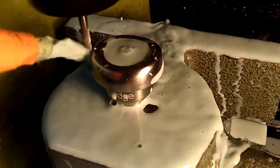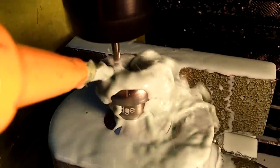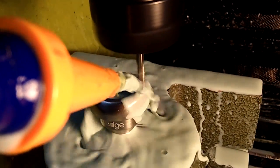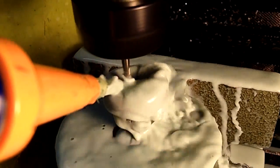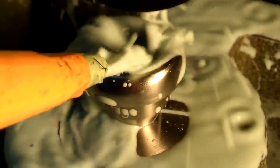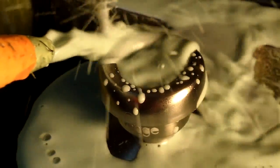You can see the sloping shoulder of the mouthpiece emerging. That sloping shoulder is one of the key components of the Wedge mouthpiece and is the reason why these mouthpieces cannot be made with a conventional lathe. They have to be first turned in a lathe and then the Wedge rim is machined with a CNC mill in order to produce that complex curve.